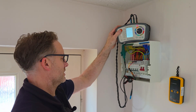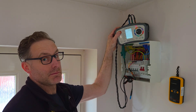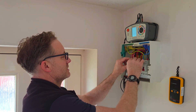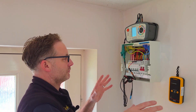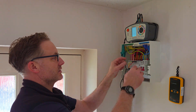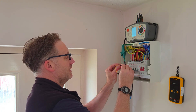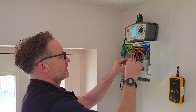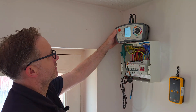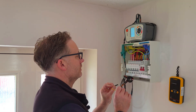Already we've got 1999 - we were above 200 megaohms there easily. We can even push that up to 500 volts because I happen to know there's no connected equipment in this property. We can take a reading off that, write it down, and I haven't had to take any of the cables out of the RCBOs or interlink them with croc clips or anything like that. Incidentally these are magnetic as you can see. We can connect them up to the next circuit - the shower - which is 6mm cable, and hit that: 1999.9 megaohms.